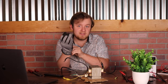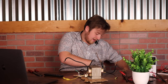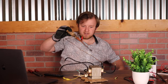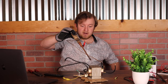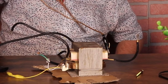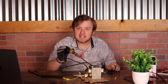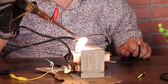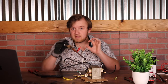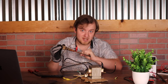Let's put on this glove to give us some insulation. If I flip this on — look at that beautiful spark! You can see that sometimes the plasma is skittering around the outside of it, and that is actually caused by the magnetic field being generated by the primary coils, because electrons are pushed around by magnetic fields.